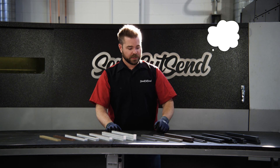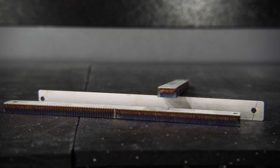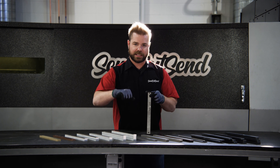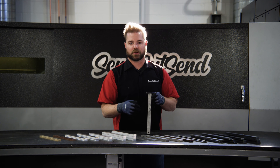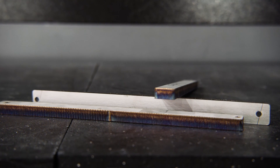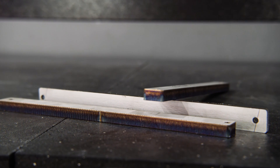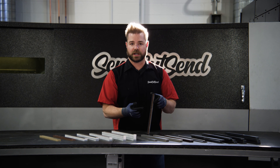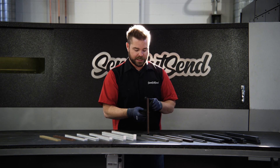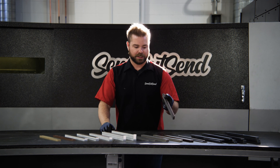Moving on to stainless steel — here we have some half inch stainless steel. This is just a mill grade finish. It's going to scratch really easily and discolor really easily. Dragging something across the top or the oils from your fingers are going to leave marks that last for a while, so be careful if you're handling it for a cosmetic purpose. This particular example was cut using our in-house nitrogen generator. Sometimes we use liquid nitrogen that's 100% pure, and sometimes we generate our own in-house. This was cut using the generator, so you can see a little bit of discoloration from the trace gases — it doesn't affect strength or heat affected zone, just leaves a little bit of color.